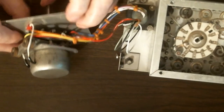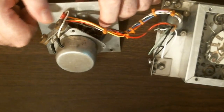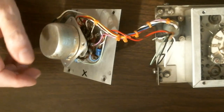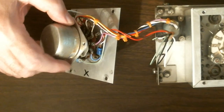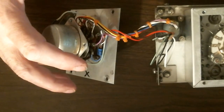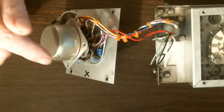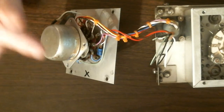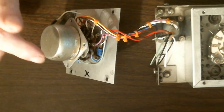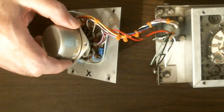This switch runs from a rotary solenoid — this baby right here. You find them at flea markets, especially in the box under the seller's table, because very few sellers know what these are for. When power is applied, it rotates 12 degrees. At the end of 12 degrees, a mechanical arm comes up and opens a switch, interrupting the power. A spring puts the solenoid back to the original position, restoring power, so it will pull another 12 degrees, and so on.